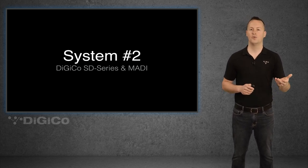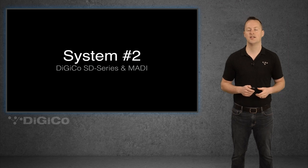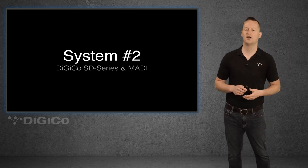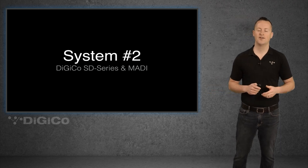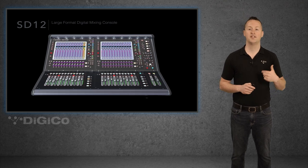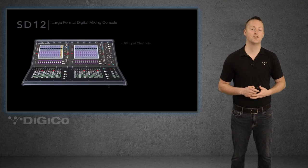All right. So MADI is also sent over coaxial cables. Typically, it does have an option for fiber, but typically coaxial cable, and it's going to give you about 64 channels at 48K. Now, to introduce this system to you, I'm going to need to introduce the SD12.